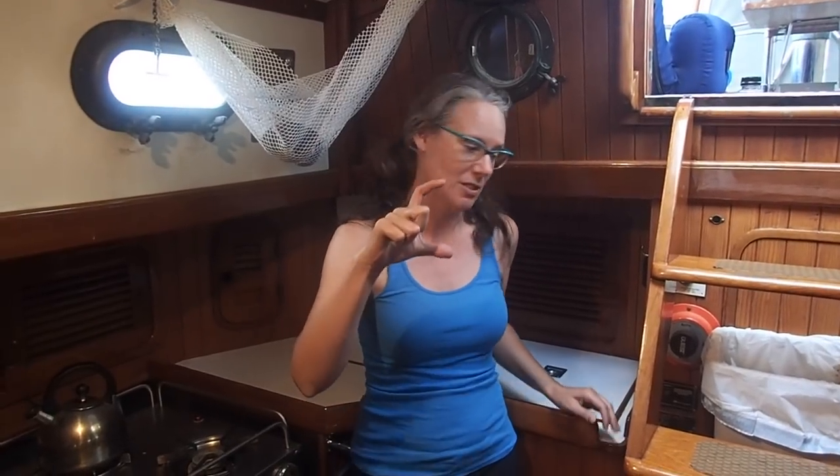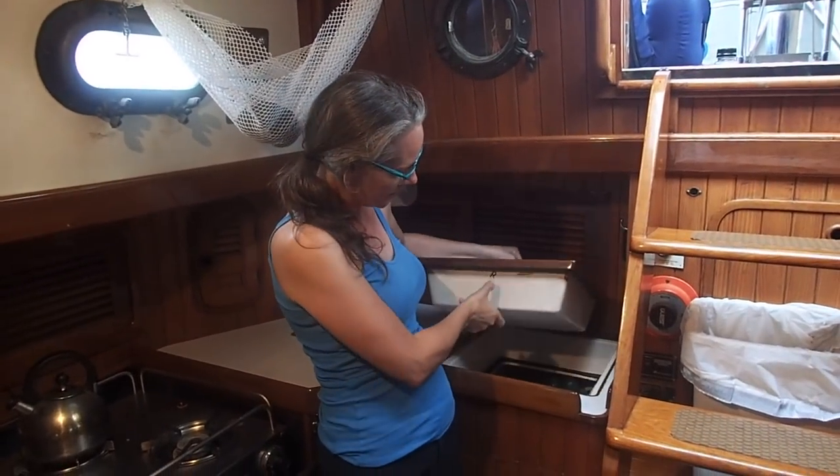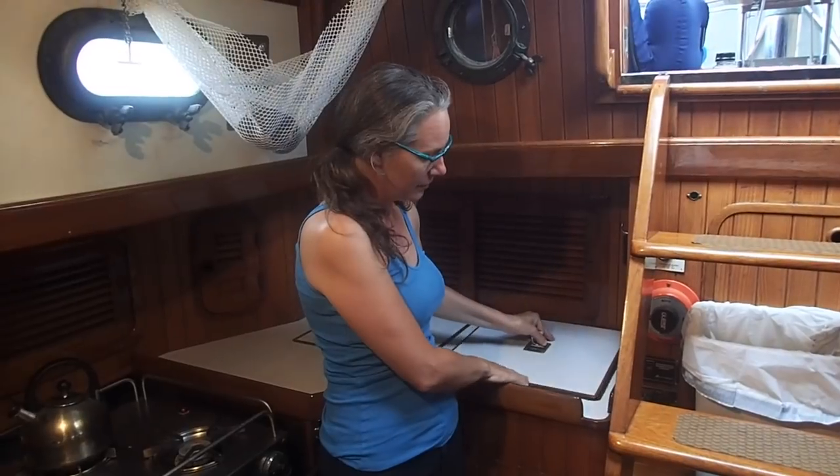We're going to be adding another 200 watts of solar, so we just want to make sure we're always ahead of the game. On a day like today, we're not getting any solar because it's really rainy, but the refrigerator is still working and everything is keeping cold. We also have a really well insulated refrigerator, and that is the key — we have about this much insulation on the top and on all the sides. If your refrigerator is not keeping cool, I highly recommend adding a little bit of extra insulation. With that, we'll get right to the footage.